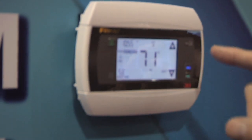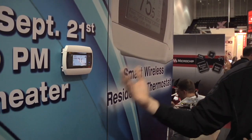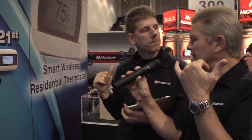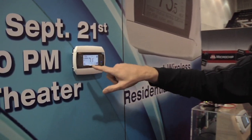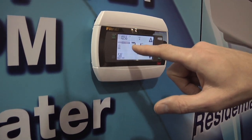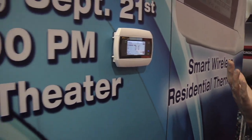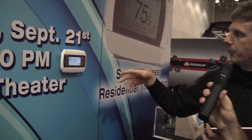You can set all of your time of week, time of your furnace to turn on, turn off, all the different time zones. So you get multiple set points per day? Yep, you get up to four set points per day, seven-day time programming. You'll notice how there's a radio link that's lit up there — that indicates that the Wi-Fi radio is linked to your router and is able to talk to a cloud server. So it's a great seven-day setback thermostat, which normally would cost between $50 and $90, but you get Wi-Fi for an extra $10 at $99.